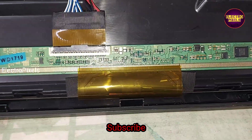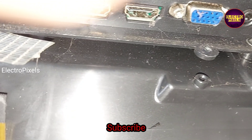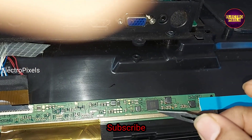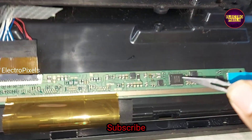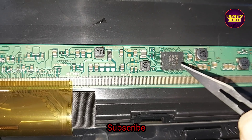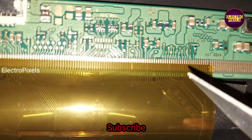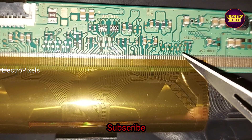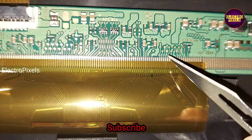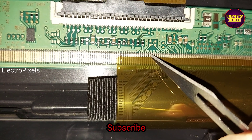These are the gate signal tracks from the right side. This is the SM4186 DC2DC IC. These are the right side gate signal tracks, and you need to cut down these three to four tracks. This is the left side gate signal tracks.